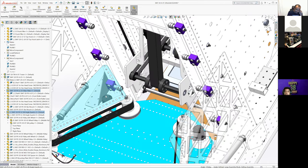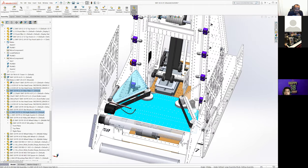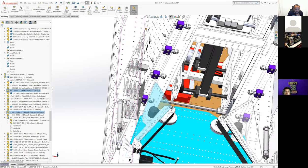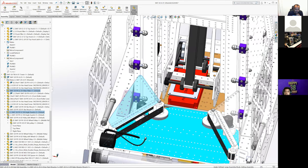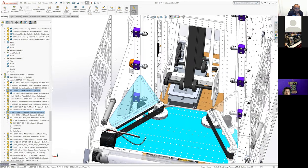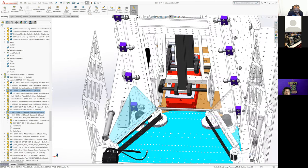The side guards were added to prevent any balls from getting jammed in the side. We still had some at Dripping Springs, so we added zip ties crossing from these outer side walls to our elevator rails to try to prevent some of that. We would have probably done some more thin features up here to prevent ball jams had the season continued. But largely this worked pretty well.